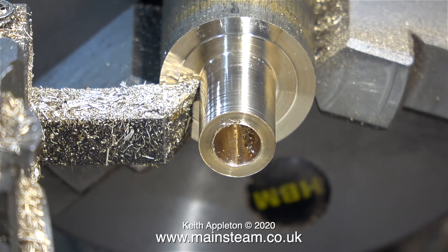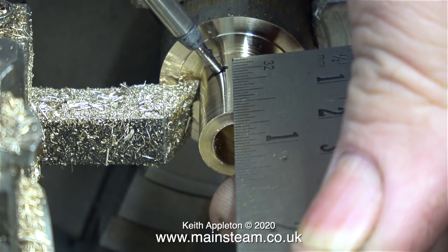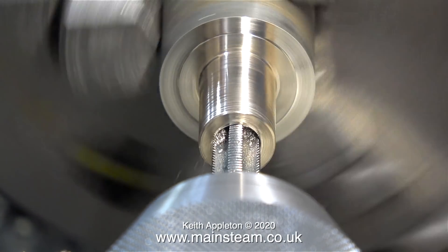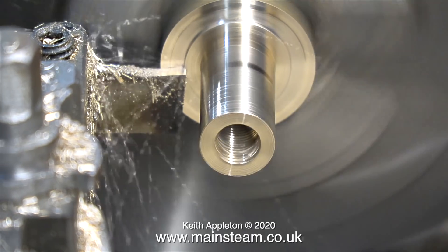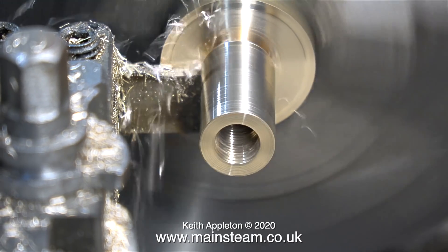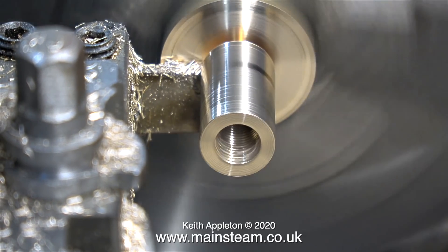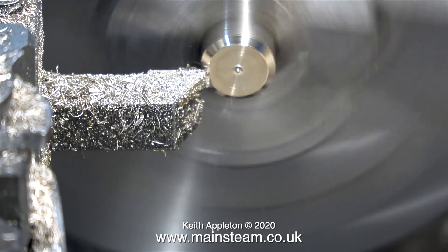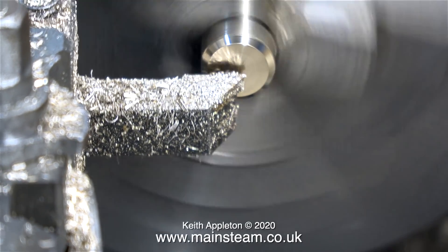Back at the boiler I measured the distance from the centre of the hole in the boiler at the top to the end of the lower bush, and here I'm marking the position of it, which is 5/8ths of an inch. Here I'm threading the hole in the top part of the assembly using a tap which is 3/8ths by 32 threads per inch. I parted off this component a little bit longer than needed because the centre hole of the vertical threaded part that fits into the boiler needs to be exactly on this mark. The internal hole was just the right length so when I parted off the component the hole didn't go all the way through. I picked up the part from the chip tray, fitted it into the chuck the other way round, used a chamfering tool to chamfer it, and then cleaned up across the front.